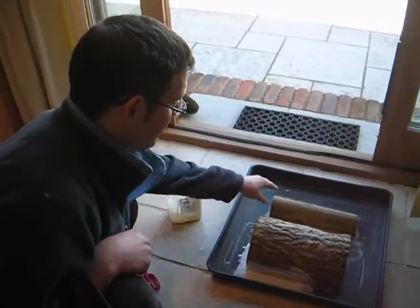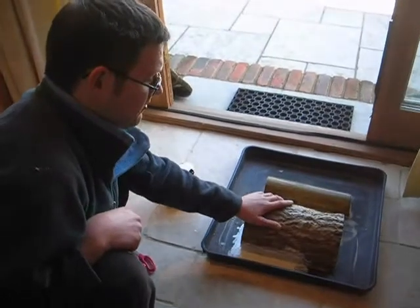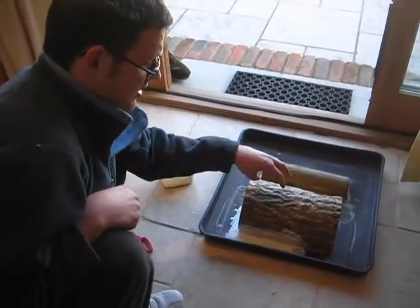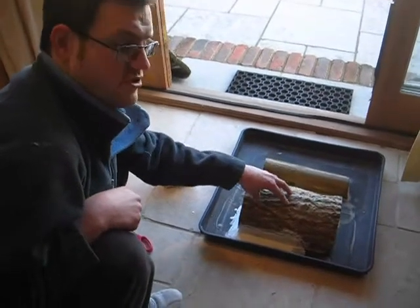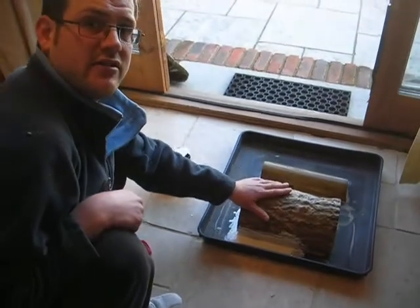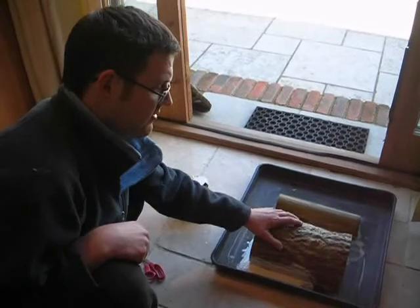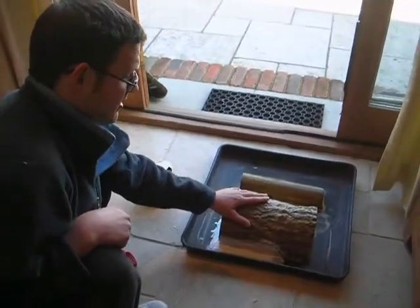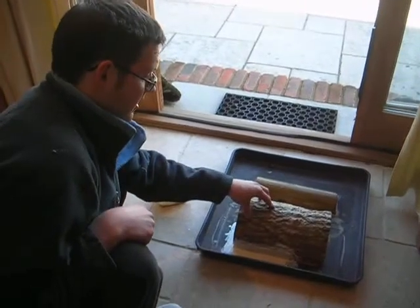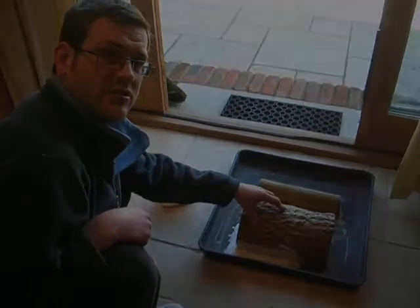With these, where it's bigger at the bottom and smaller at the top, no mother mould is going to be needed, because I'll take the original log and imprint it into some soil or sand, and that will hold it rigid while casting whatever medium you decide. So yeah, this is an experiment, so I shall keep you up to date. I kept a tally sheet also with the amount of layers, and I shall join you later on.